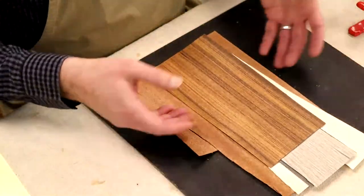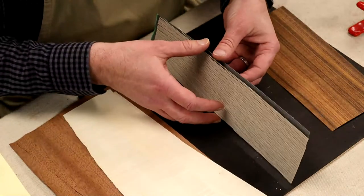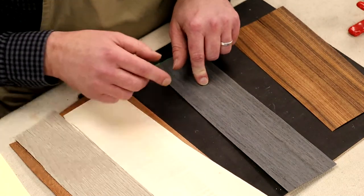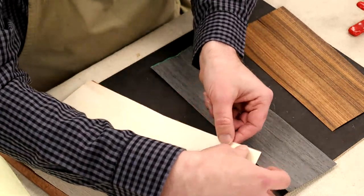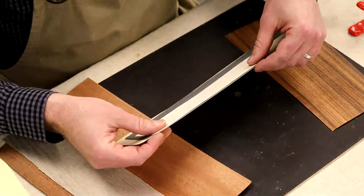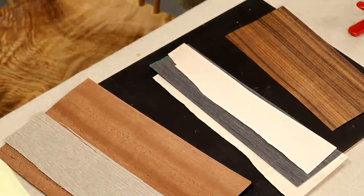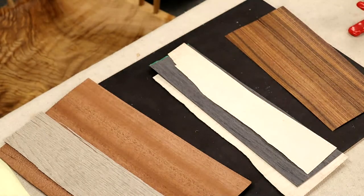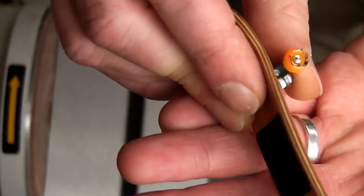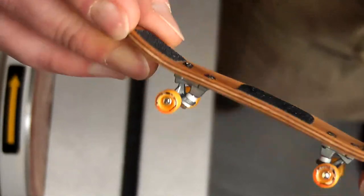It's very simple. Choose whichever colors you like. I've got some really nice ones. What I try to do is if I've got quite a dark color, use that as the center of the laminations, and then put two really light colors either side of it — sandwich that dark one between two light colors. That's when you see the lamination really jump out when it's all glued together. You can see the nice little laminations on the deck there. Really nice timbers, these veneers.